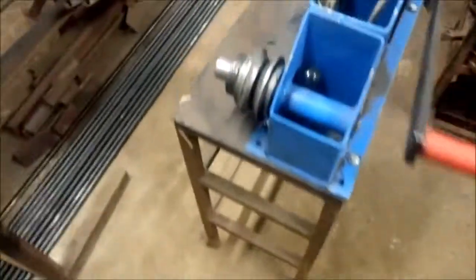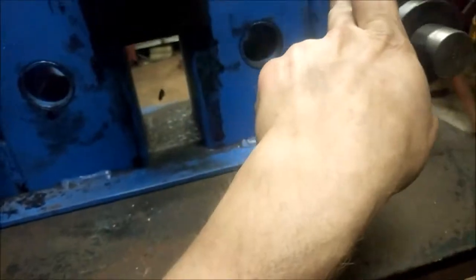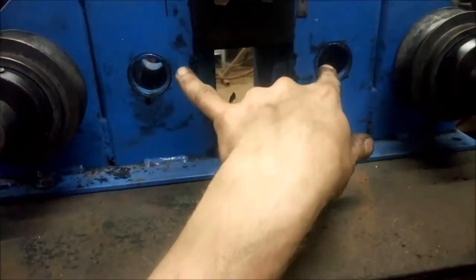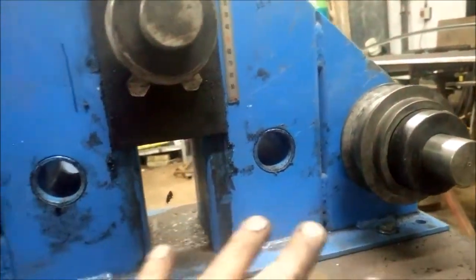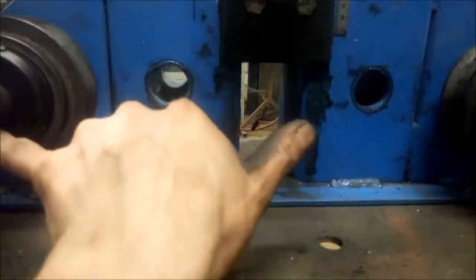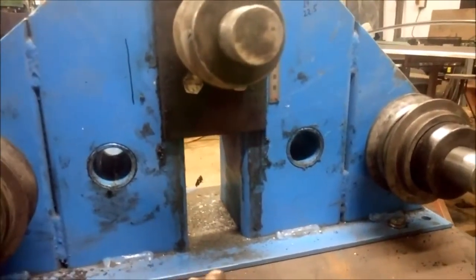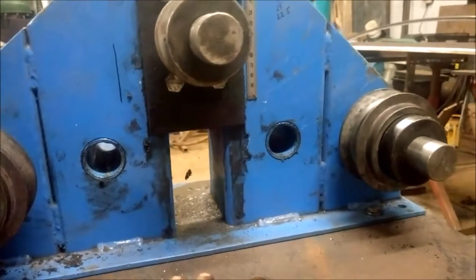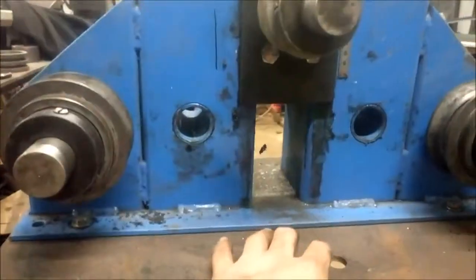The only parts that don't roll are the very ends, because from that point there to that point there, there's nothing. This roll is quite good because I can move them to there as well, and that produces a shorter distance that won't roll. But because this is quite a large span, these are quite large, gentle curves, I thought it best to put the rollers out further and sacrifice just an extra little bit at the ends. But having bought steel long enough to do at least 2 poles per bar or tube of steel, sacrificing that much shouldn't matter.